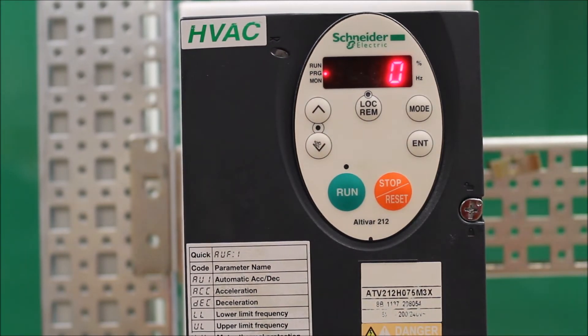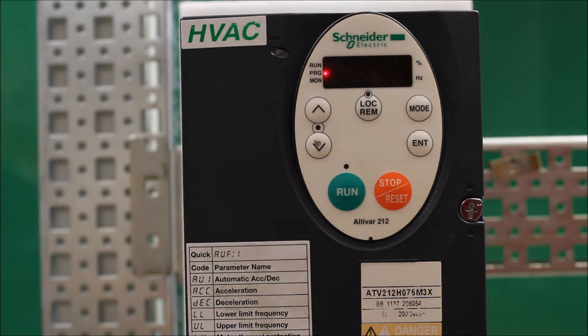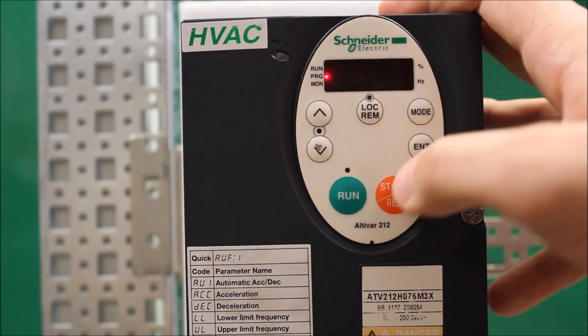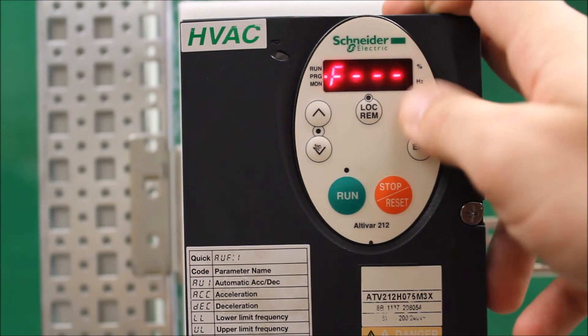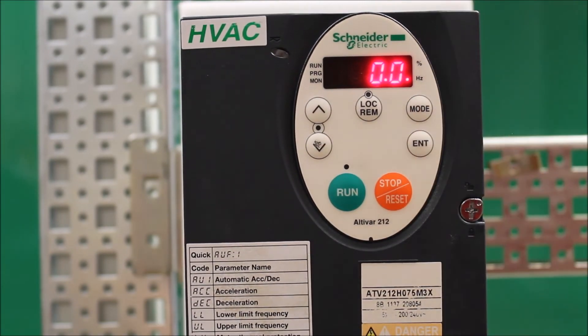The normal value is three. I already have it disabled, but normally it's a three. If you want to disable that, you need to set it to zero. Once it's zero, you can run the drive just like you would normally, as if you have a motor on there.